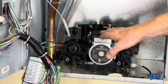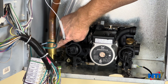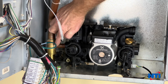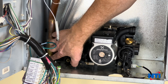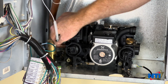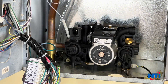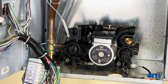At this point, the two pipes are removed. We have to now remove the relief valve connection. If you have an older TX boiler, you may not have this pipe going through the cabinet, in which case you're free to just pull this directly out of the unit. This is a newer style, so we're going to remove it by taking the three screws out from underneath — they're a 3/8 head sheet metal screw. Once those are out, we can pull this pipe out of the bottom, push it off to one side, and then finish removing the IWC.